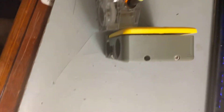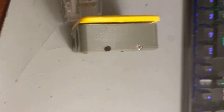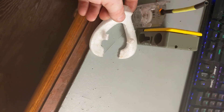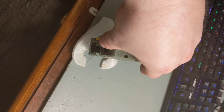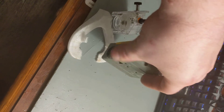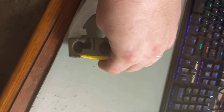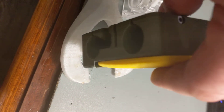This thing is going to have a fan duct system. It was adopted from the MK4 X carriage system. This fan duct will go underneath like that and bolt on right here. Your nozzles are going to be sitting right there dropping down, and the fan is going to catch that right here and help keep the nozzles cool. On the back it's going to have a 5015 fan hanging off the backside, and it pushes the air to the front — boom. And you've got the linear rods right there of course.